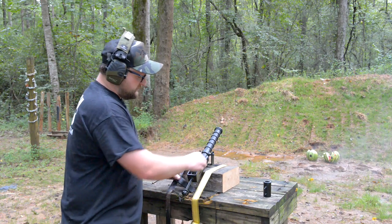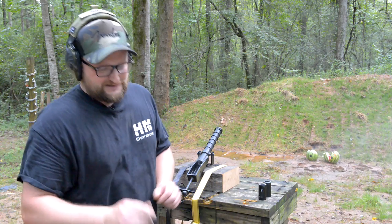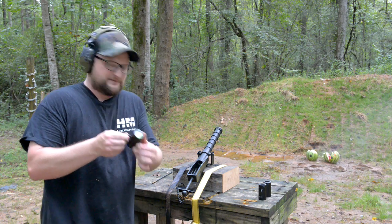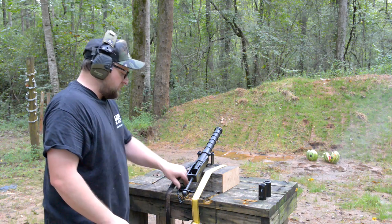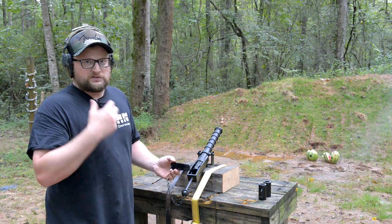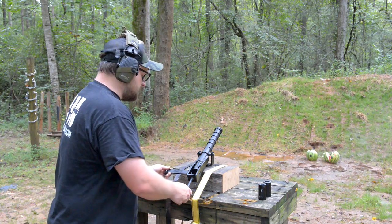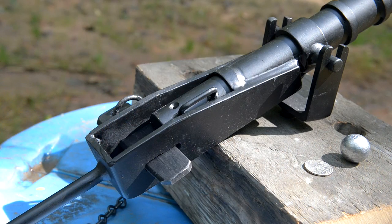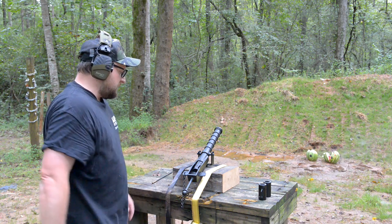Not only can we shoot a solid projectile out of this, we can also shoot a buckshot round. I've got another canister here loaded with buckshot — this is 20 pellets of double-ought in this cannon. We're using an 80 grain charge of black powder, so not a huge charge. The salute loads on these little cannons are about 230 grains when you run it with a blank; when you run with solids or buckshot, you want to get it down to about 80 or maybe 100 grains. You've just got this wedge here that's timed and keyed — the rear cup goes in and you push it over to the right, put your wedge back in, and that's what holds it shut during the firing cycle.